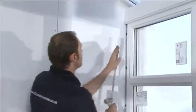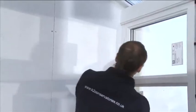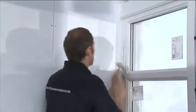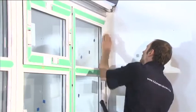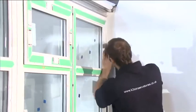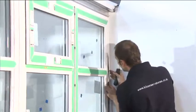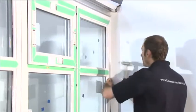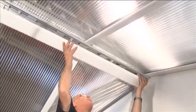Position an 18 mm coupling cover over the barbs on the inside of the post and push to fit. The 18 mm coupling covers will need trimming to fit underneath the external eaves beam trim and eaves beam cover. Select the 18 mm coupling covers and position onto the recesses of the sides of each quarter turn button on the 18 mm inline couplings and push to fit. Repeat for each inline coupling and on the inside.